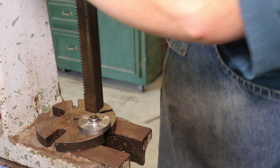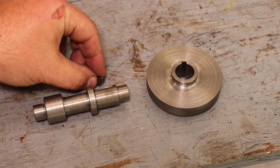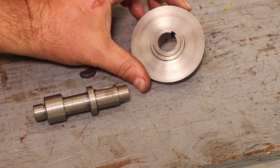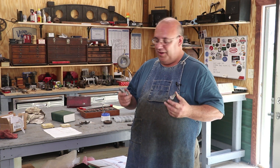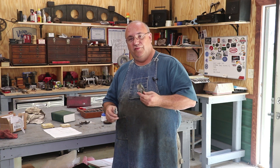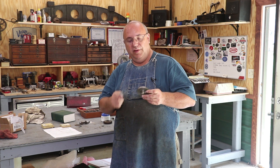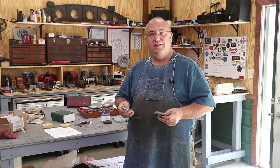Just a little close-up of the finished pieces here — we got the Woodruff key and hole here. Of course that's the Woodruff key; we will wait to put that in right before we put it together. And then of course the broached hole over here on the other side. Everything should be ready to assemble now. Well there you go guys, that's my process on how I cut the Woodruff key as well as broached the keyway in the hole. I need to cut the teeth on the small gear before we press these together, so we'll wait and do that right before we actually start milling the teeth. But with that, that'll be a wrap — thank you guys for watching, I appreciate it. In the next episode we're going to be cutting some gear teeth. Catch y'all later.